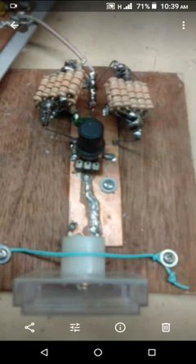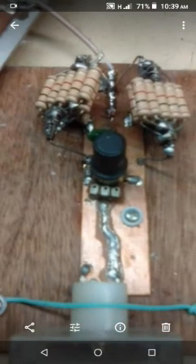I built a power meter with a dummy load using 1 kilo-ohm 2-watt carbon resistors all in parallel. You should get 50 ohms resistance when they are all together. Sorry for the blurred image again — there is a 1N4148 diode.